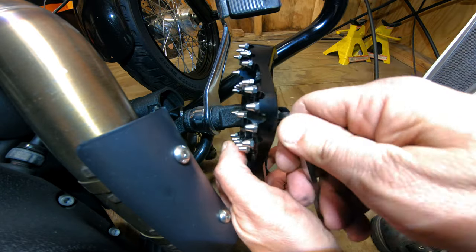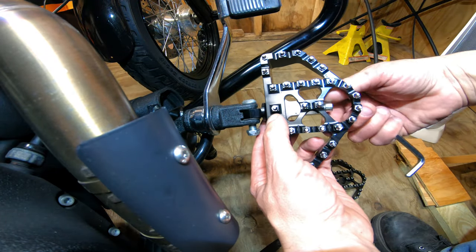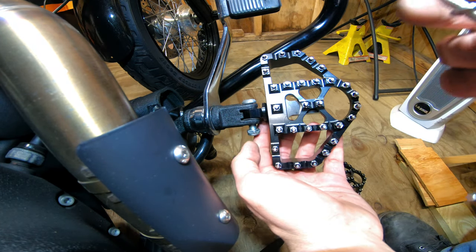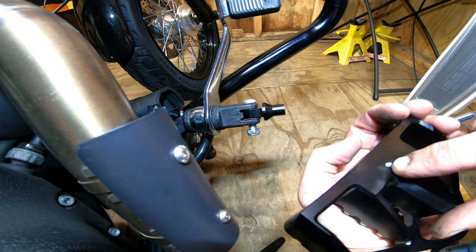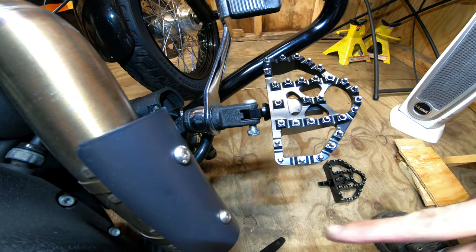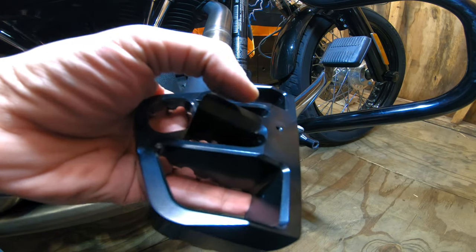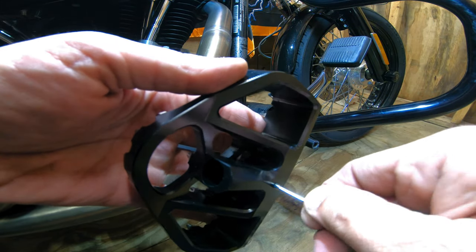There is a little locking washer in there. I'm gonna remove that little set screw, add loctite to it, put this in the position that I want — it's gonna be like that — and tighten everything all up. Do not lose that. Put a little bit of loctite.